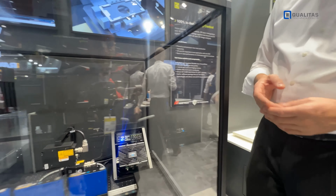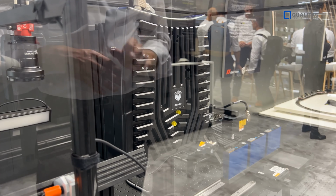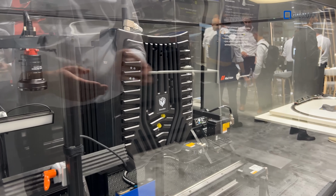Next we have the confocal scanner with a line length of around 16 millimeters and a measurement height range around 5 millimeters. And the repeatability is really in the submicron range, 200 nanometers. Wow. Or even better. So a very, very accurate system. And with the confocal scanners, there's also another big advantage. With a laser scanner, when you look at something very shiny, like a mirror, maybe you can still detect something like 7 degrees tilt. With our glass scanners, it's maybe around 10. And with this confocal scanner of the G5 series, it's up to 20.